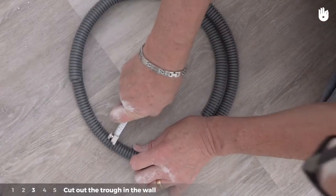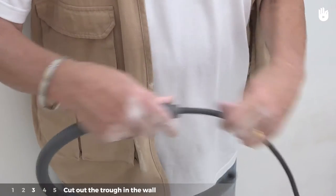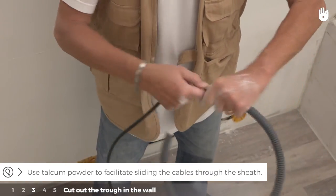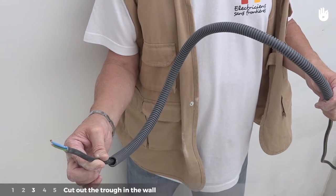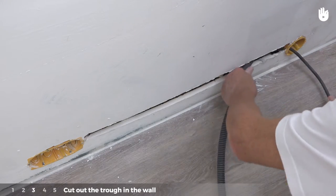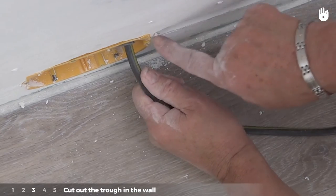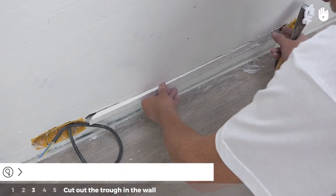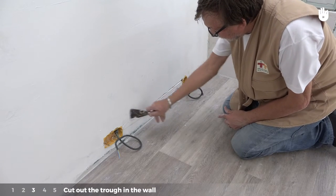Measure the sheath and cut it to the necessary length. Prepare the walls for the casing for any embedded switches and outlets. Place the conductor in the sheath, using talcum powder to facilitate sliding the cables through. To avoid crushing or overheating conductors, leave some extra space in the sheath. Then put the ensemble into the trough and slide the sheath into the holes for the casing until the sheath appears. Fill in the trough with plaster so it is flush with the wall — you can reuse pieces of the wall you cut out to fill in the trough and re-plaster. Let the plaster dry for two days.